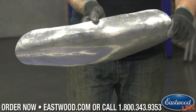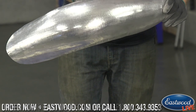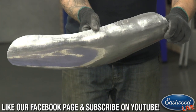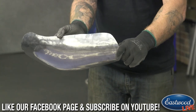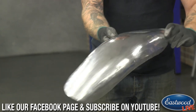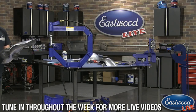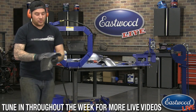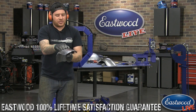The reflection isn't bent too much. If you get to an area where it starts to bend, then you know you probably have a spot that needs to be addressed. So that's getting pretty close there. I raised up that center by stretching it. You could do it with the hammer as well if you wanted, in the sandbag again, and then go back in. But I just wanted to raise it just a little bit.